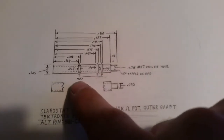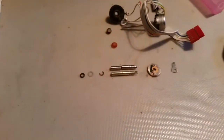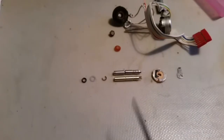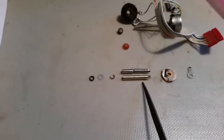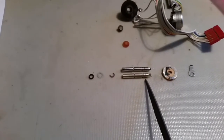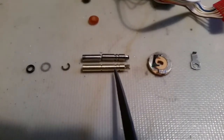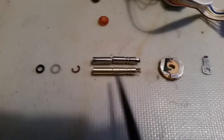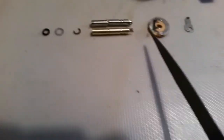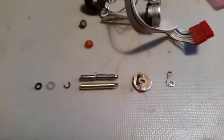My only real issue is I'm missing a snap ring right here. Let me get it out and show it to you. Alright, I've got it out here. This is what I'm missing. These pieces — this one goes right here. The washer goes next to it. And in the bigger groove right here is where the rubber goes. That rubber is to make sure that this shaft doesn't turn while you turn the inner shaft, which actually goes through it. This is a double-ganged pot.